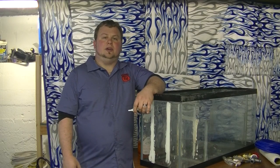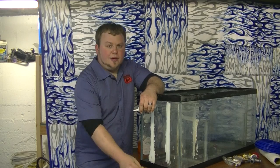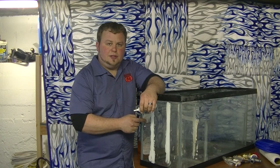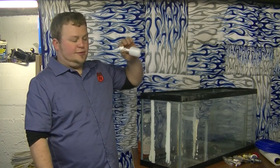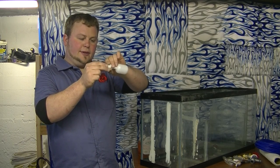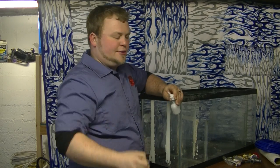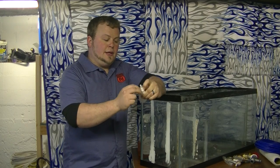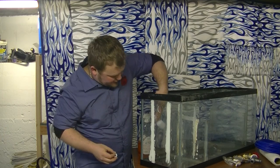Okay, we're back down in the basement here, and I'm going to install a float valve now. I will mention that you need to take some kind of sandpaper, any kind of grit really will work, just to knock off the real sharp edge that you just made with that hole. Now, if you get the float system identical to mine, it came with a seal, a clear packing washer, I would say. You want to keep that seal on the float and then put the float through the tank and then put your outside nut on there.